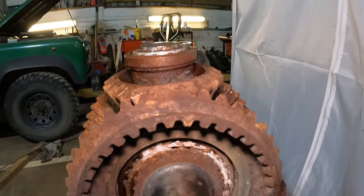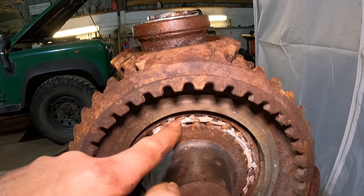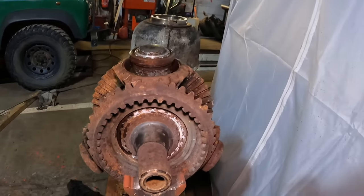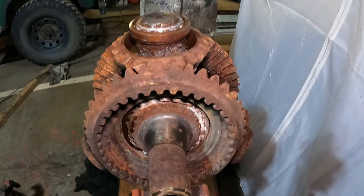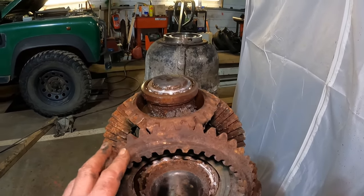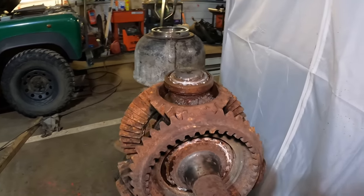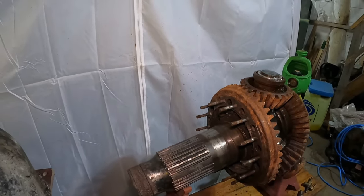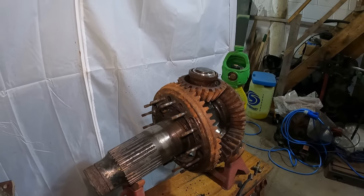and that just leaves the very poorly looking bearing at the back. As you can see, it's broken up. Obviously, part of it looks like aluminium. Well, I think that's due to this actually being bent. That could be the problem, because this needs to rotate separately to this part. The bearing obviously makes that happen. So what do you think, folks? Do you think we should attempt it? I'll remove this out of the way, the fixed gear, and then we can see a little bit more.